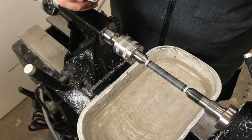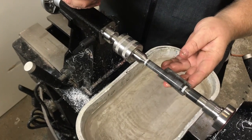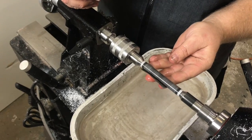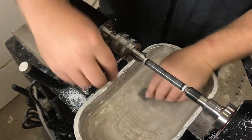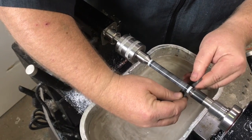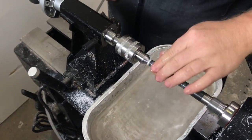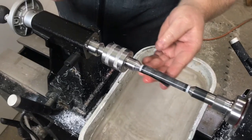I'm going to slow my speed down to around 1200 for this, and I just want to keep my sandpaper wet. The whole point of the 800 sandpaper is to sand out any lines, bumps, or inconsistencies. Once I feel I've done that, I can go right to the Zona. I'm making sure to get my ends good here — getting them rounded over or at least flush. The flatter you turn your blank, the quicker you can move off the sandpaper.